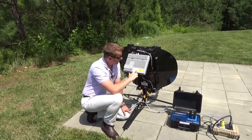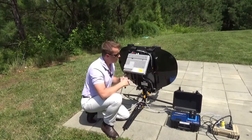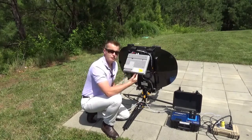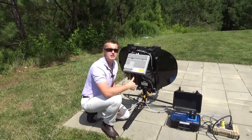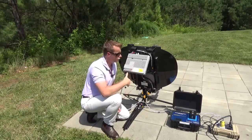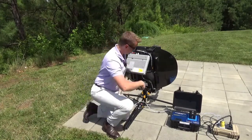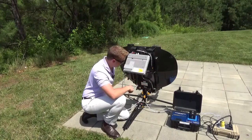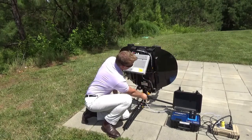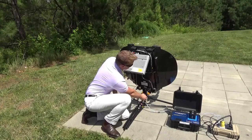So whilst we're in fine point mode, you'll notice on the crosshair that the lights are all lit up. And what we want to do to get to the maximum pointing is to get all the green lights right to the edge of the crosshairs. Whilst you're going through this process, the terminal is also going to be going through a continuous calibration process to detect the highest peak that we've just received. You'll know that you've found a new peak when all the crosshair lights flash at the one time. So what I'm going to do now is firstly adjust the azimuth fine pointing. I'm finding new peaks here because I'm seeing the crosshairs light continually up.